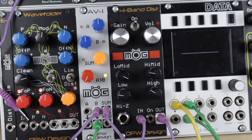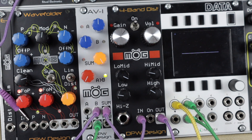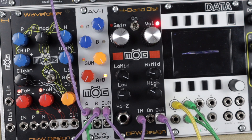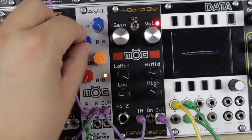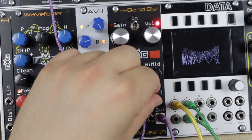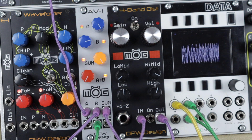What gets really interesting is feedback being disrupted by something else. That's why I'm using a mixer here — not only to create the feedback path, but to feed something else as well as itself into the distortion. If I come out of channel A directly and plug this sound in, it's a low-pitch, pinged filter — kind of like a soft bass drum sound. Now if I start feeding this back on itself again, I love that kind of weird tremolo vibrato wobble that's just appeared. Feedback's always a weird, interesting thing to experiment with. With some careful knob turns, there's definitely a lot of interesting feedback interactions to be had.